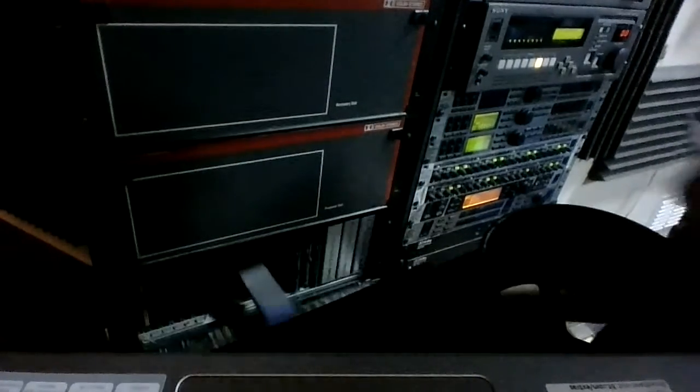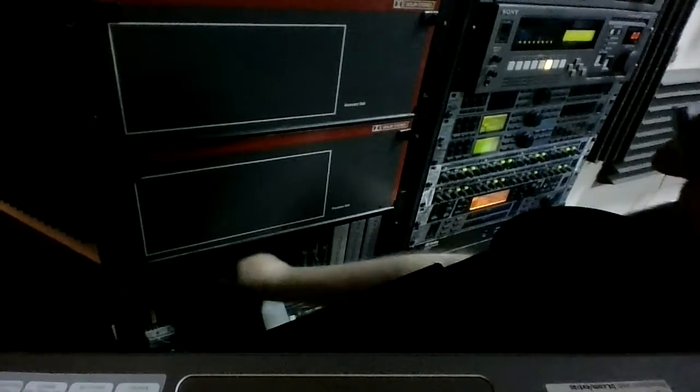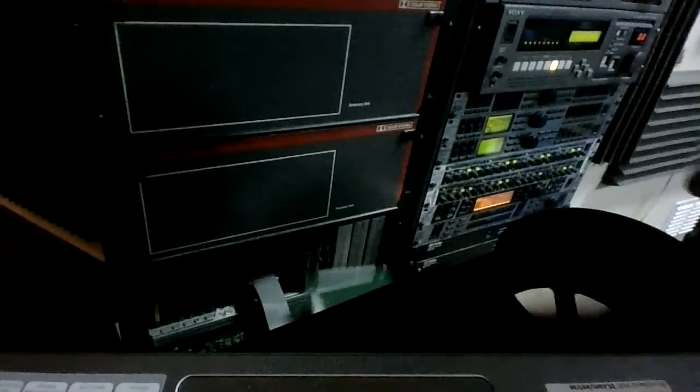Open up the panel. Oh, it's down here, isn't it? There it is. Take the bus logic card out. Oh yeah, I've got to attach that back onto the. So it's probably where the soldering iron lifted the circuit tracks. They're very fragile. So I've got to make a bridge.